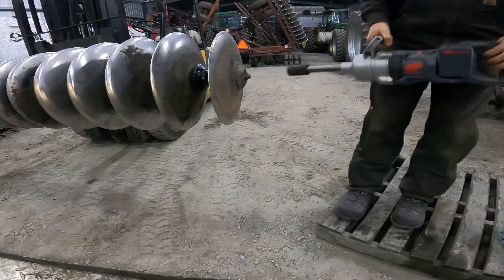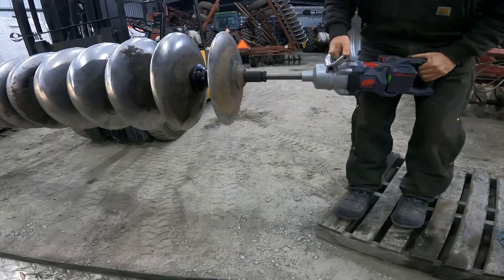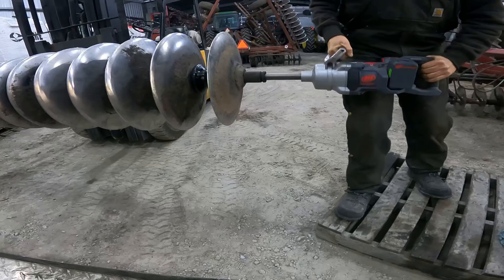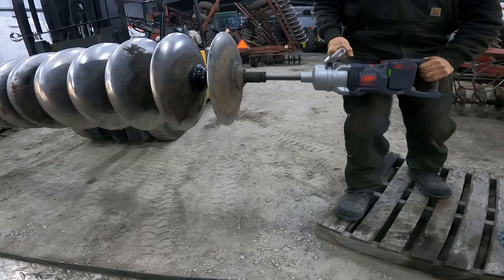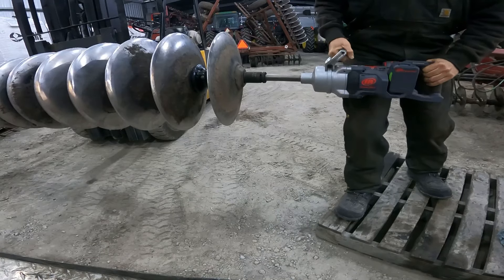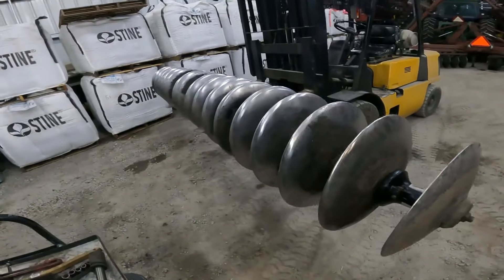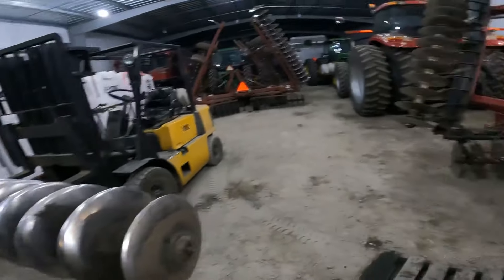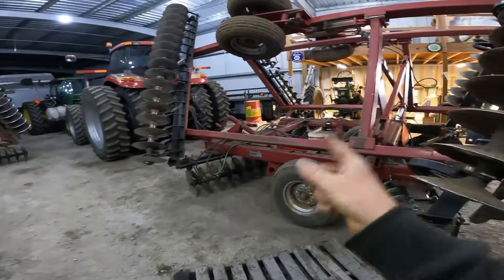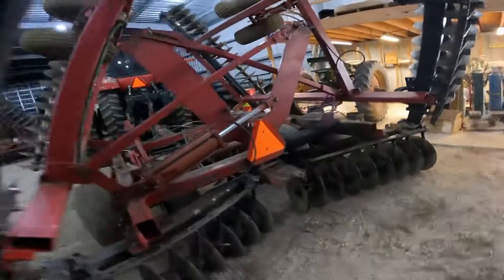That's got this thing ready to hang back onto the disc. I've just got to get this pallet moved out of the way and get the red tractor and this disc backed out and run out of the shed. I'll show you here on this one — I've pulled the cylinder off; you can see it was leaking like a sieve. I took it apart and this big piston seal was all dry-rotted with a great big crack running right through it. I'm waiting for a phone call to let me know my parts are in. I'll get that put back together and put that wing cylinder back on the disc.